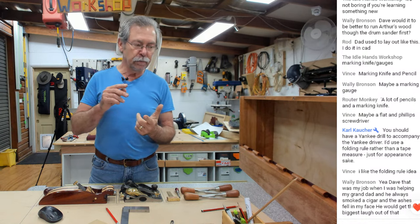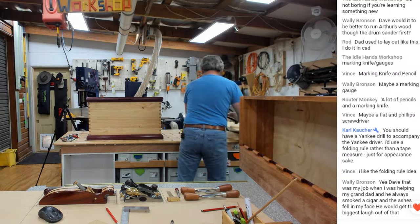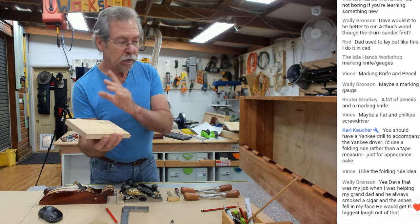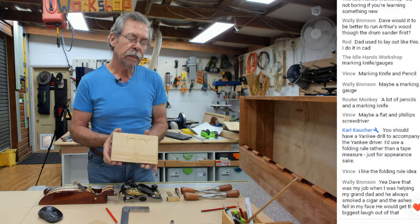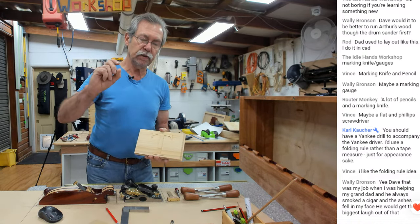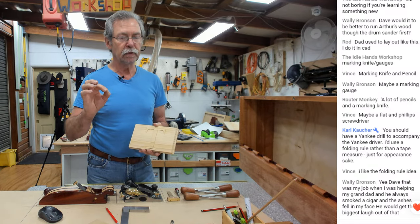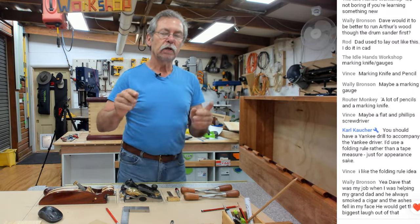So today I've gone through cutting the male plug off the female section on inlay, and the issues that I had with that one, that I didn't set it deep enough. I should have set the female to 6 millimeters deep. I should have set the start depth on the male to 4 millimeters deep and the flat depth to 2 millimeters deep. So if you can work with those ratios, it'll work very well for you.